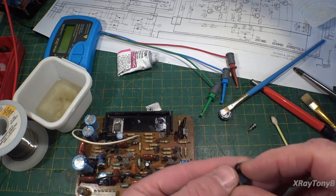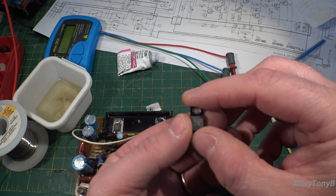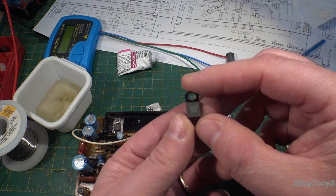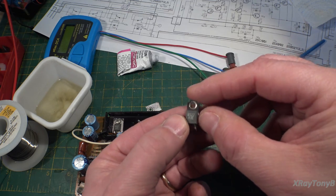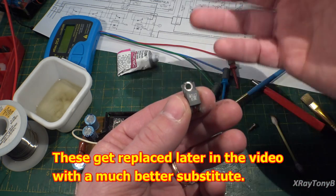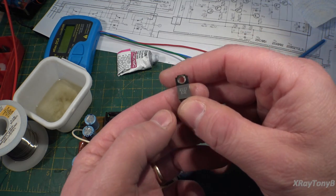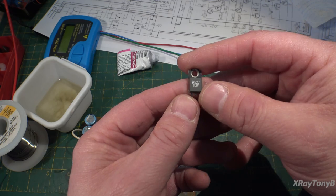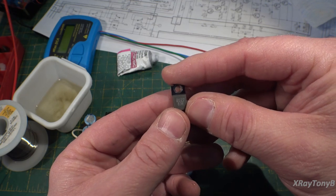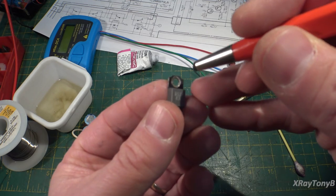The first thing I want to do is clean this transistor up. I'll put it on the tester and make sure it's good. Of course you can't prove it's noisy or not noisy, but these are very hard to find. There are some in a TO220 package with similar characteristics, but I don't think any one will exactly replace this. I did find some Toshiba ones I could order if I really need to, but I'd prefer to use the correct parts if there's nothing wrong with these.